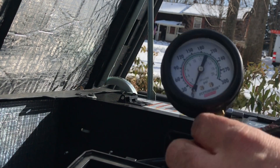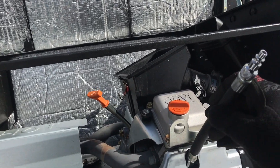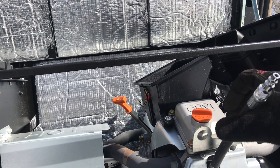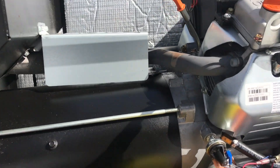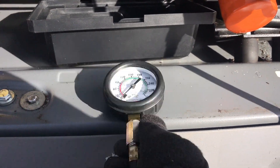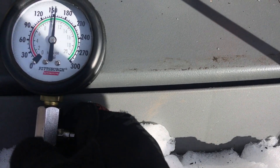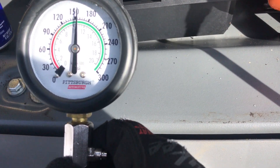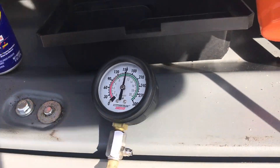My compression is still good on both cylinders. I have better compression on the back end than the front end, but from this engine getting overfilled, I don't think it did any damage that would mess with the compression — even though everything in the generator got soaked and saturated. Let's redo this one; it never hurts to redo a test. I'm happy with this compression test overall.